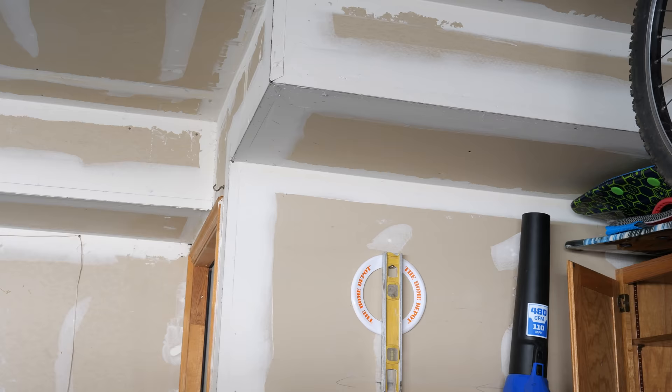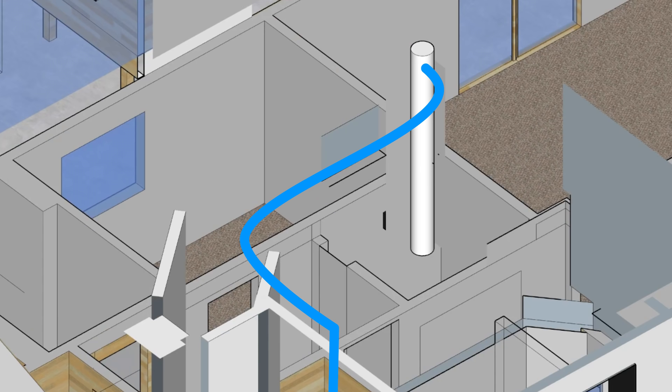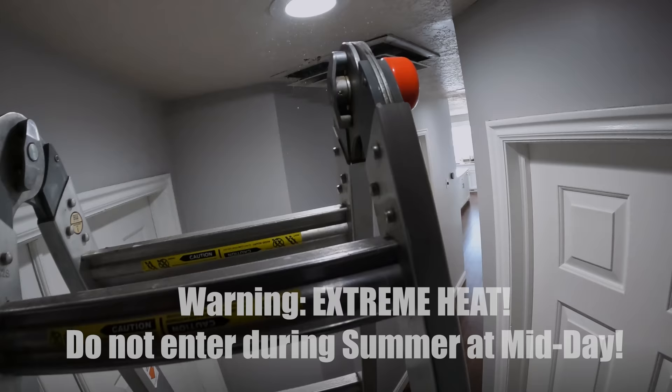So I don't want to do that. Another option is I could go beneath this floor into the garage and route it through the garage somehow into the room — but again the wires would be seen and I would need outdoor cable. The third option is I go up to the ceiling into the attic, then over onto a wall and down through the wall into the electrical room where I have my network system. That's going to be the best way to do this, so the first thing we need to do is head up to the attic to make sure that would be possible.